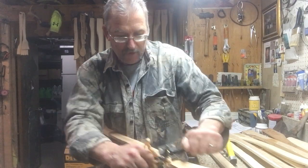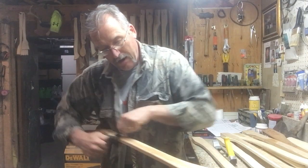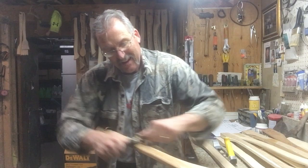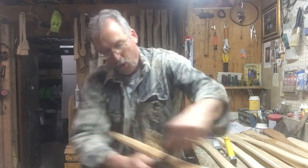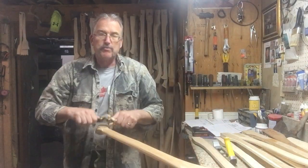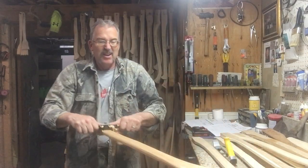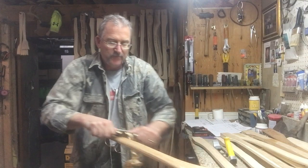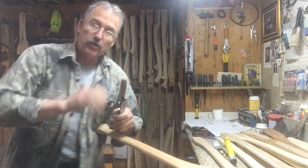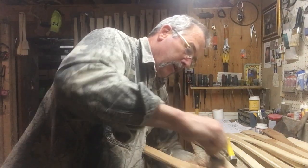There's a little bit of grain here going the wrong way, so I'm going to just get rid of it. Round out the front side. I'm almost there on this quarter of the handle. Run your spokeshave the whole length of it so you get that nice smooth straight surface from top to bottom. That's a little bit of a gouge going the other way so I'll take it out. Then we're going to the back - half the handle is done in just a second.